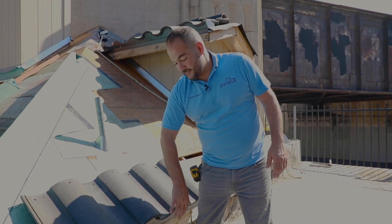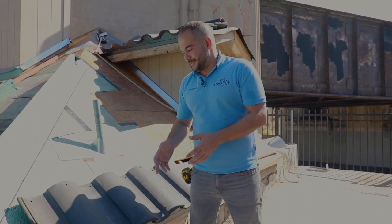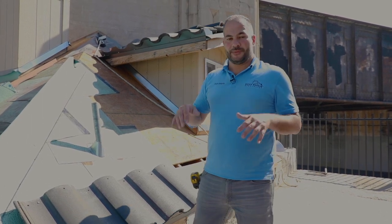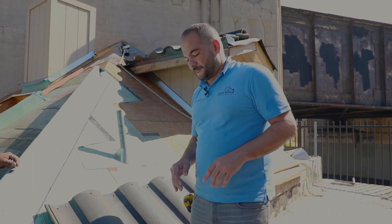The eaves and the first few rows of tiles tend to lift up more. Also, the idea is that if a tile in midfield slips, it's not as dangerous as a tile at the eave. If it slips, it's going to fall off the roof and possibly hurt someone. So some manufacturers require the first 2 or 3 rows to be installed with more nails. However, again, the manufacturer is not as important as your specific area and the winds in your area. Like in our area, we have Chatsworth, which gets super strong winds. So in those areas, we always install 3 nails in the first 3 tiles.